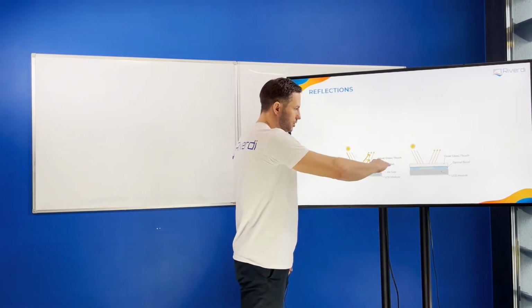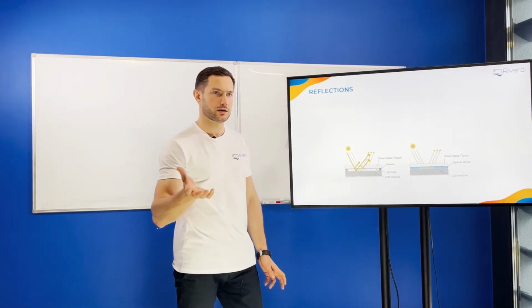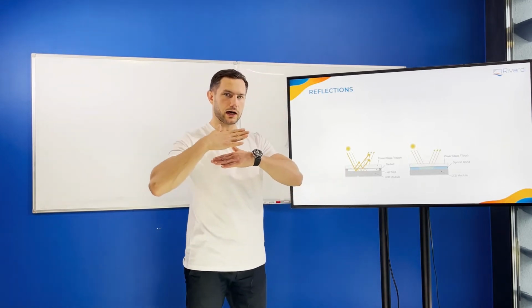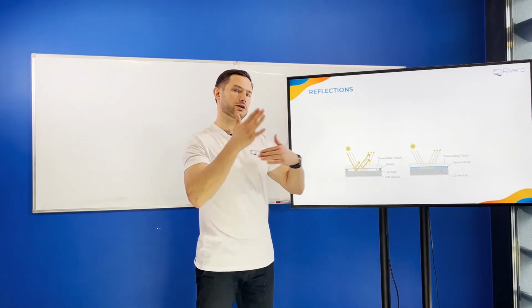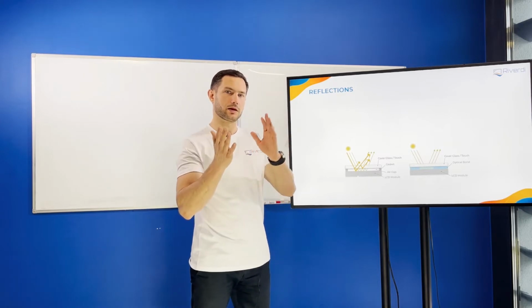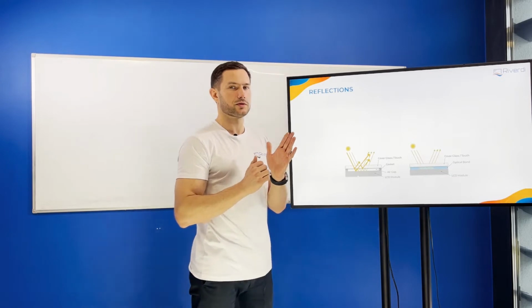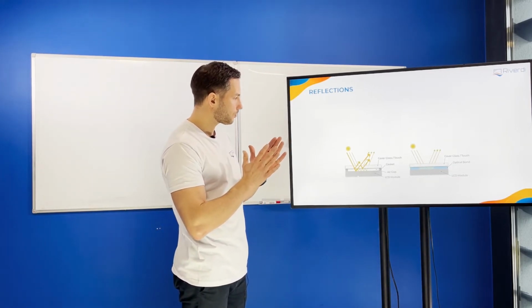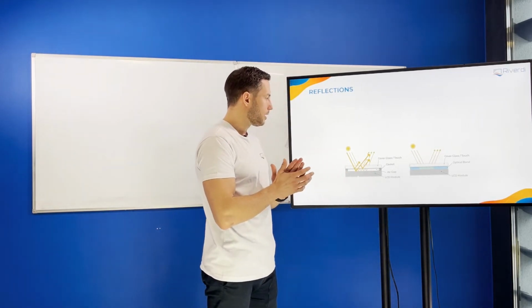So we put additional glass. Sometimes it's just cover glass, sometimes it's a glass with touch, depending on the application, and they are usually separated by a layer of air. It has a lot of benefits, like mechanical benefits, because it's easy and cheap to assemble this way, and also if the glass is destroyed and the display is still okay, we can just replace the glass easily. If it's outdoors, it's sometimes very useful. Something may happen to the glass, and we may easily replace it without replacing the display.